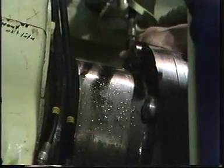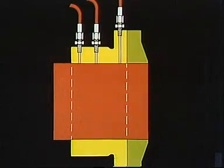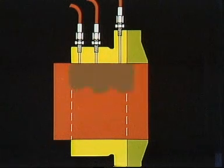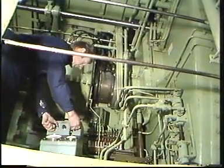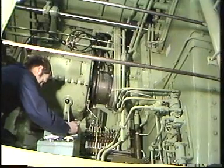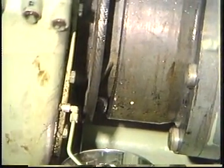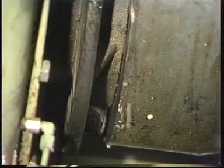The hydraulic tool is now connected to the coupling flange nearest the chain transmission. Hydraulic oil can be led through channels to the joint between shaft and coupling flange, hereby releasing the connection. Apply pressure to the hydraulic tool until oil trickles out between the shaft and the flange. Oil pressure should be supplied during the complete adjustment. The camshaft can now be adjusted and the adjustment checked with the pin gauge.